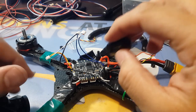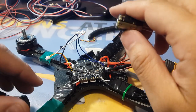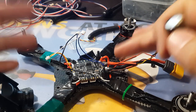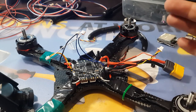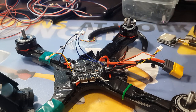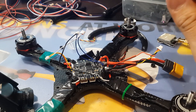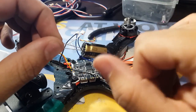I made a little recording of me just punching out on the table with no props, and you can see the OSD flickering. When the props are on there are obviously more voltage spikes that cause more problems. I think after a while the regulator on the PDB just starts to get weaker — that's my theory. The voltage spikes are just affecting it more and it's getting more sensitive now.